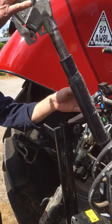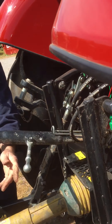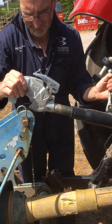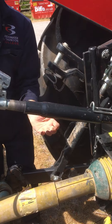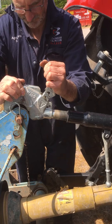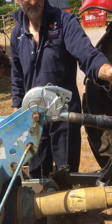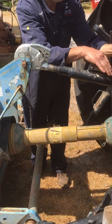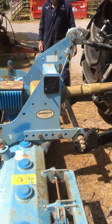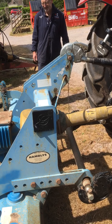All you have to do is lower down and adjust it from the middle — don't just adjust one end. Adjust it through a few turns, lift up the clip, and hopefully it fits in nice. Then just a little turn of the top link. When you get to the field, you adjust the top link to make those adjustments for the power harrow, just to make sure it's sitting level in work.